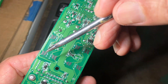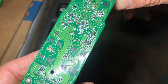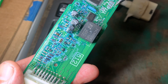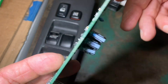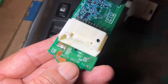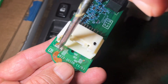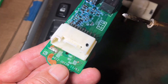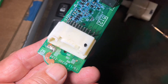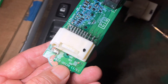So you would have to do just what I did for the passenger side rear — find the correct soldered joint, look for corrosion on one side, or flip it over and find the corresponding soldered joint on the other side and see if you have damage there like I had. I just did not have the right soldering iron — I needed a micro tip, a skinny thin tip. I had a fat one and tried to use it; I butchered this board. But thankfully I was able to fix it for $13. I got lucky with that.